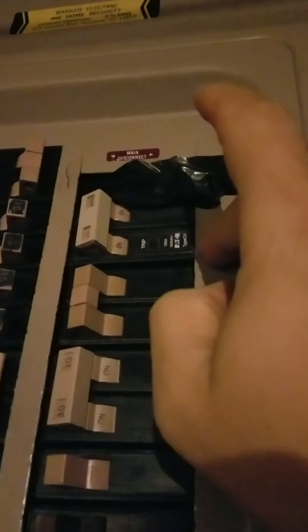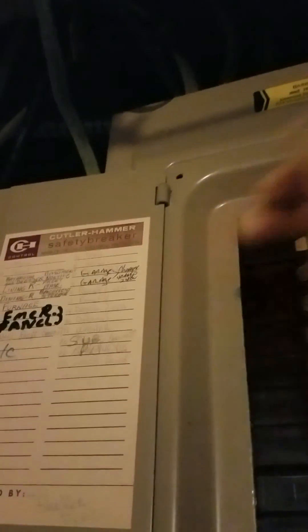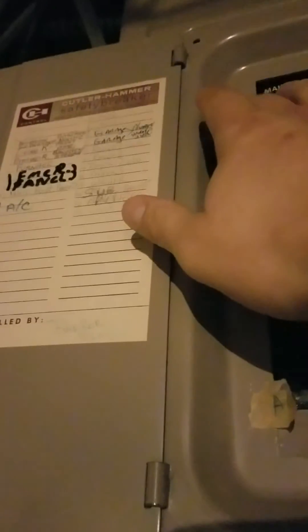Red wire, black wire — it doesn't matter, it's interchangeable. On the left-hand side of your panel you're going to have a bar where all your white wires are going — just screw it down for your white wire, and same with your green. White is neutral, green is ground, so they can both go into that same sidebar. Your green and white go into that sidebar, and your red and black go to your breaker — flip it, and you're good. That's about all there is to it.